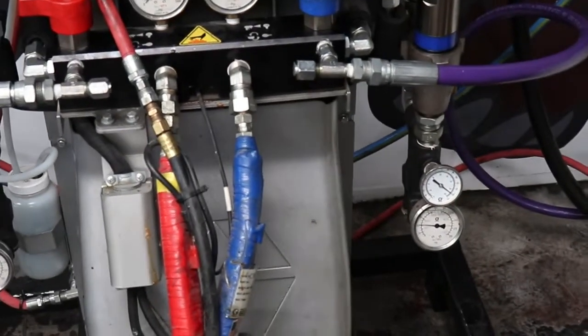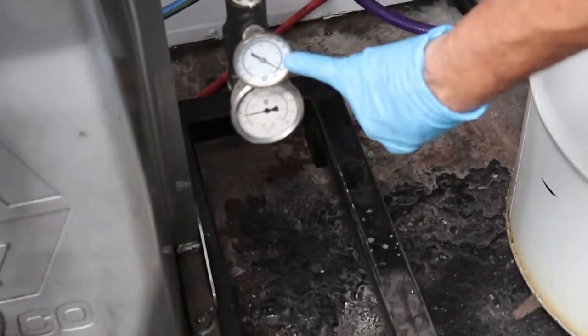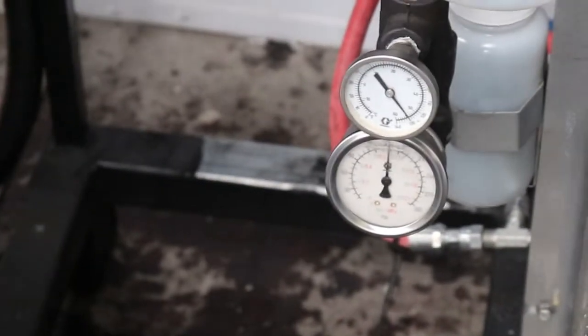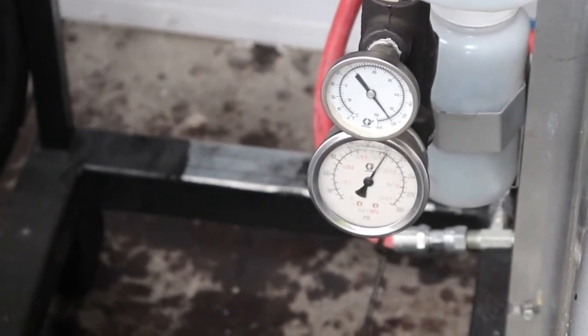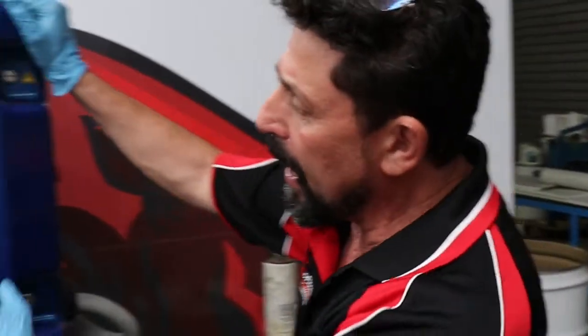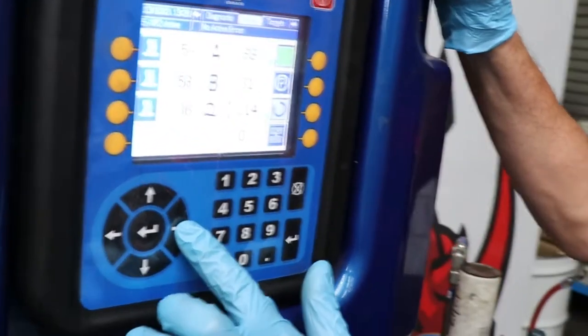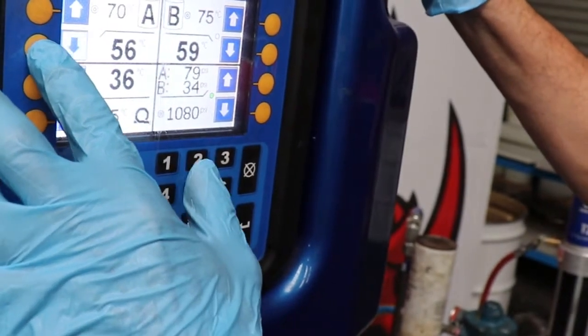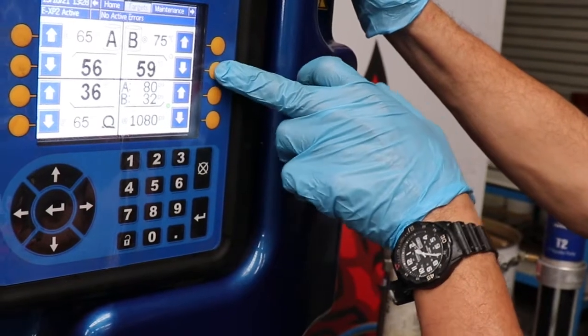The machine's been running for a while now. Let's check our temperature — both drums are heated up and you can feel them nice and warm. This machine has an external thermometer on the pickup. You can see the temperature is about 55 on both sides, which is what we want for our product. As it goes through the machine and into the hoses, it'll get up that little bit extra. Now that we've come to the right temperature, we want to go back to our temperature setting. We had them at 75; we want to get the ISO down to 65 and our resin down to 55.